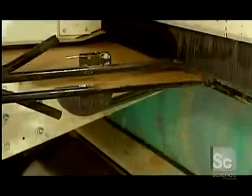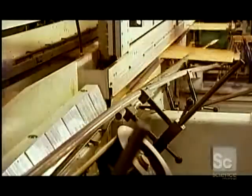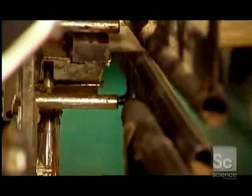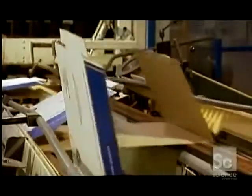Workers send the cut-offs back to the paper mill to be recycled as many as six times over. A folding machine now bends them along score lines the corrugator made earlier. It then applies cold glue to the sections that'll join together to form the box — hot glue if the cardboard is wax coated. The next machine folds over the glued sections, which aren't visible once the box is finished.